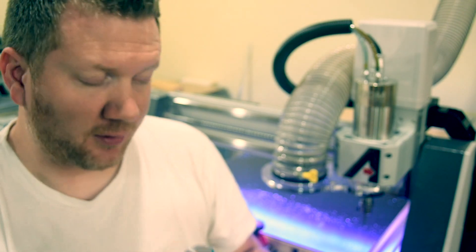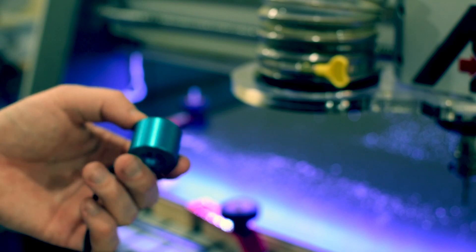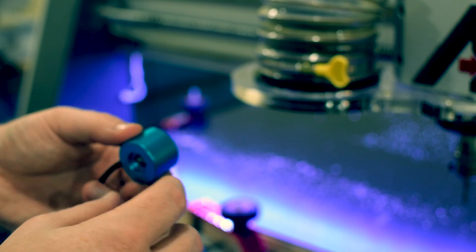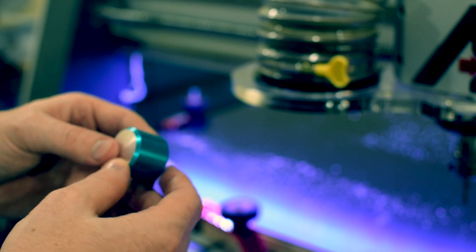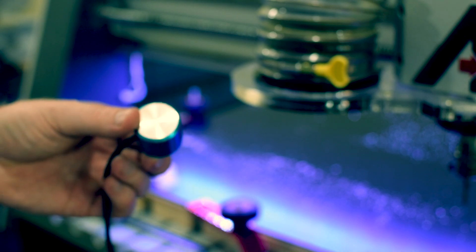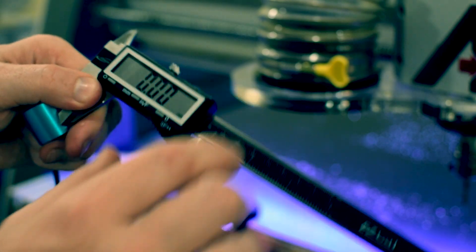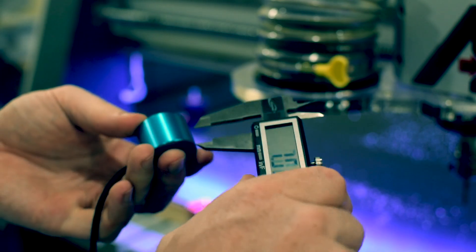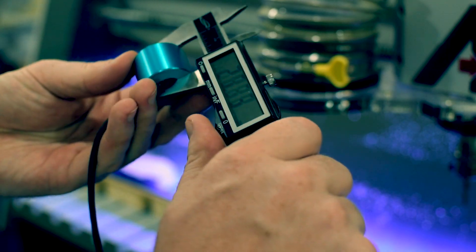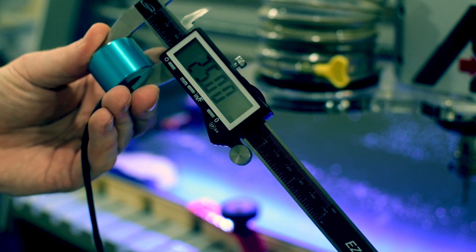With a caliper you can do that, so I'm going to show you how to do that right now. In my case this is barely used, but I want to walk you through the process if you were to sand this down. You're going to need a set of calipers, or something highly accurate that you can set to millimeters. I'm going to get the size of this — which is exactly 25 millimeters.